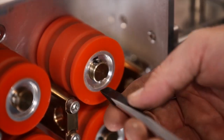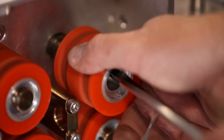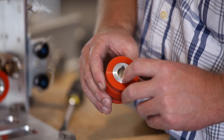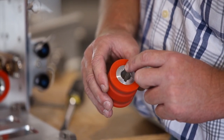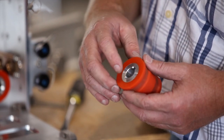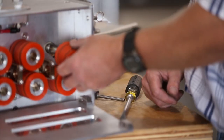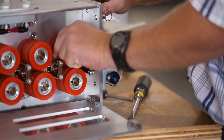You just want to hold it up while you pull the roller off. The round part is for the roller detent and the square section is for the keyway. As you reinstall the roller, you just need to make sure that the detent is facing down, the key is facing up, and you install it to where it starts on the detent and then simply push it on until it clicks.